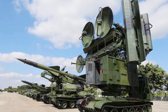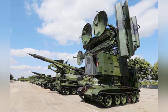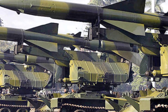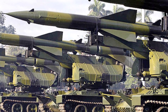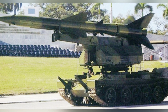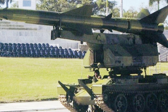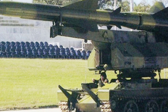The combination of the T-55 and SA-2 is not a very complicated engineering task, as it does not involve integrating radar scanning equipment or guidance devices. It simply involves installing the missile launchers on the tank chassis, transforming it into a mobile launch vehicle with slightly stronger mobility than the original towed version. From the photos, it can be seen that the Cuban designers removed the tank turret and installed the SA-2 launch rail in the original turret ring position. The rail can be adjusted in elevation and rotated horizontally, and can carry a single missile.